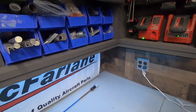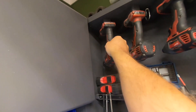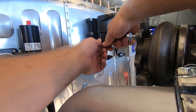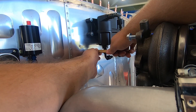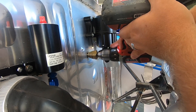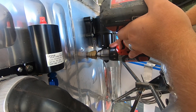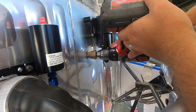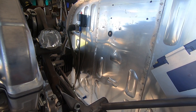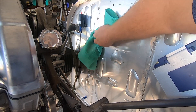Stainless is hard stuff and you'll see here it's time for me to get some new step bits, so take it easy on me. I'll be using an all-metal eyeball-style grommet that I found on Aircraft Spruce. The size wasn't quite big enough so I did have to enlarge the hole, and although that wasn't difficult I just felt it was worth noting — the link will be down below if you're searching for something like that. I imagine this whole process would be a whole lot easier if I took the boot cowl off, but I decided to just suffer through it.